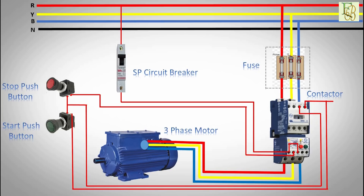The NO terminals on the contactor, 13 and 14, connect them in parallel to the start button as a holding contact. Connect the A2 terminal to neutral. You can add some features, such as a lamp signaling the tripping of the motor protective device. Add another lamp and place it between the A1 terminal and neutral; the lamp will turn on when the contactor is energized.